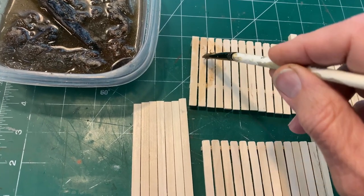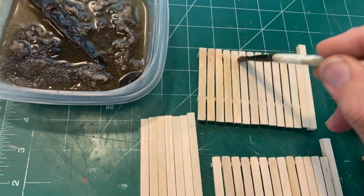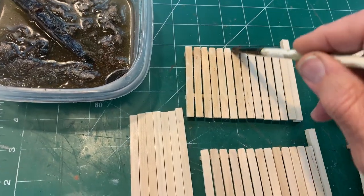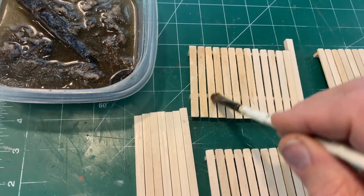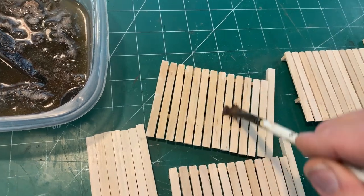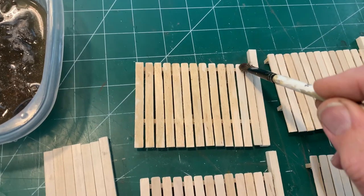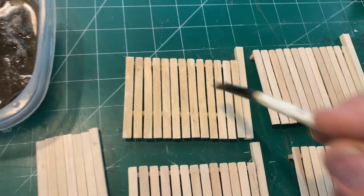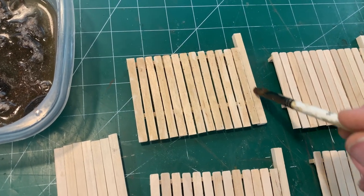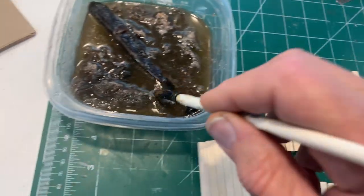What hadn't quite occurred to me is that over time, the rust has been sitting in the vinegar, making it an even hotter and hotter mix, which is going to turn the wood even darker and darker. So when you're doing test strips, when you find the right color, get your rusty bits out of the vinegar. You can always put them back in, but if you leave them in, your mix is just going to get hotter - and by hotter I mean darker and darker.